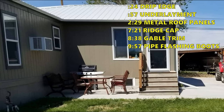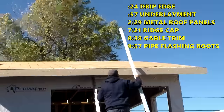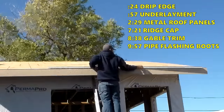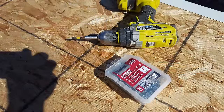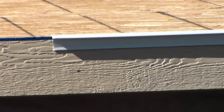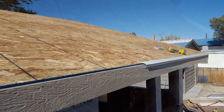To start with, I have just a bare roof with just OSB sheathing. The first step from this point is to install the drip edge. This installs right at the edge of the roof in the areas where the drainage will occur. To secure the drip edge, nails or flat panhead screws can be used. Drip edge may not always be necessary when using metal roofing, but I prefer to use it because it gives more protection to the fascia, and appearance wise, I think it looks nicer as well.